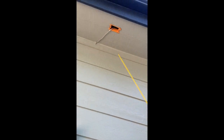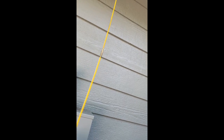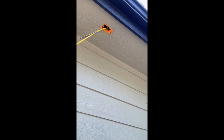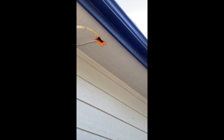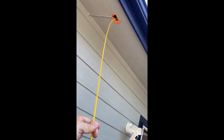So there's my outside hole, and then I take some of these rigid fishing lines for electrical and stick it up in there, because it's kind of a low ceiling in there. I can run it back towards where I can get to it — I can get it up to the ceiling without having to climb in there.